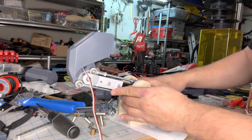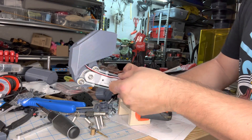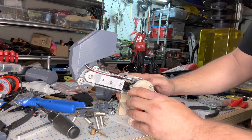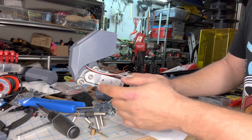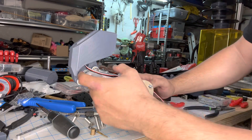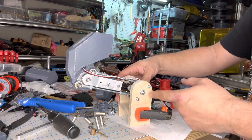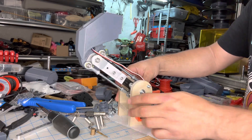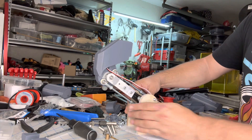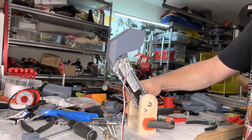It'll get hidden with rust and stuff like that. I still need to do the wire management, and these aren't the final screws — this is just temporary for the test. Basically it's a piece of 2020 extrusion with some aluminum rod ends and quarter-inch threaded rod, along with some bearings and pillow block. There'll be a big servo in the body.